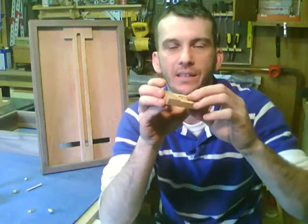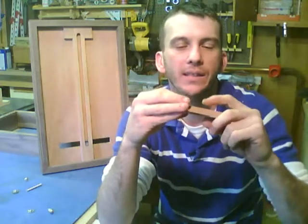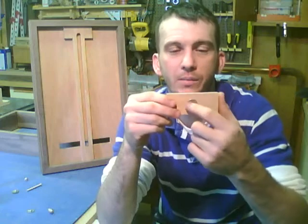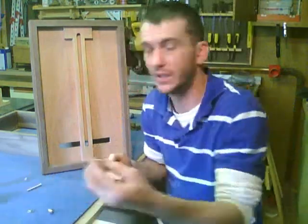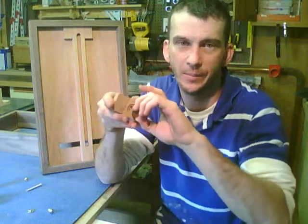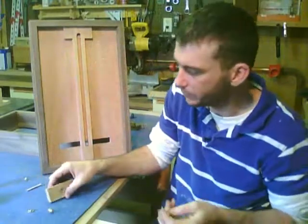Is a recess, and same thing on this side, but on this side I went ahead and glued with the Instabond that nut and washer assembly already in there. Now the nut and washer assembly for this side doesn't get glued in because it needs to be able to move freely to press against this support arm to lock it in.